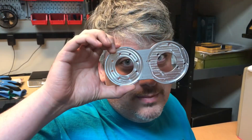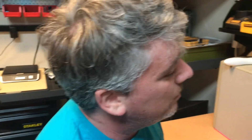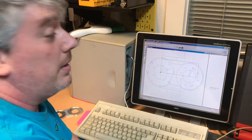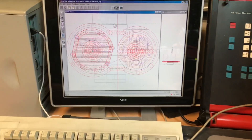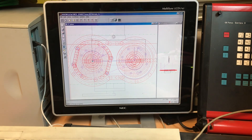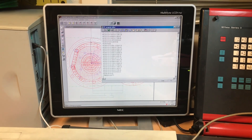Doesn't this look like the TaskBot logo? This is the first part we're making today and it starts with CAD — computer aided design — so we're going to take this part and redraw it in our software. Then we switch over to CAM — computer aided machining — where it takes the tool and lays out all the different tool paths. This is something I pre-programmed, and once you have the tool paths you can use this to generate your G-code. These are the actual lines of code the milling machine is going to follow to create this part from scratch.